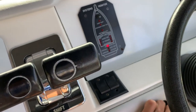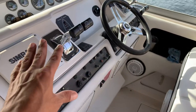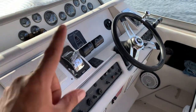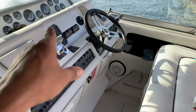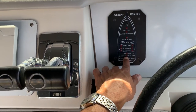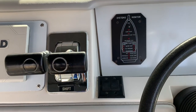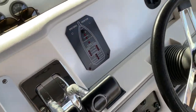If I turn the bilge pump on, you can see a light goes on. If you don't have a light or something to let you know the bilges are running, you really do want to have something like that. If those bilges are running, you want to know. So if either bilge pump comes on, I would know right here at the panel. I have the aft bilge pump and then the emergency bilge pump, and that's what makes the difference in how those three wires are used.